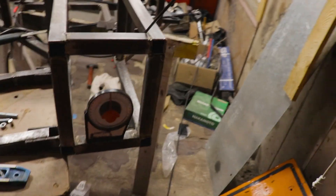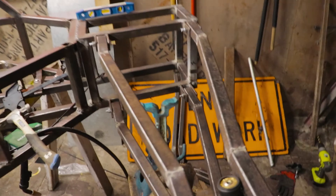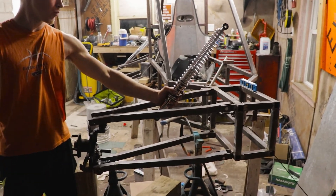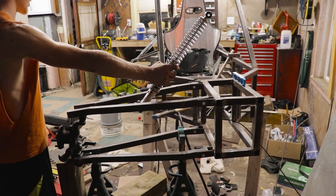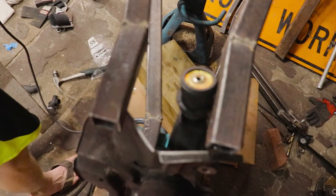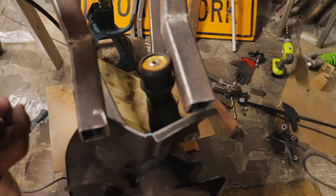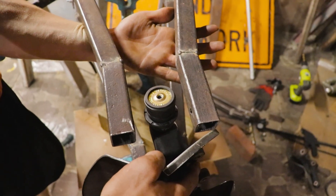As well as the other side, then we should be good to go. One side tacked up looks quite boxy, but once you get the shock in there, not too bad — something like that. Definitely beefy for sure. For the top here, it's a press-fit ball joint, so we're going to mill up a plate that'll be about 3 inches by 3 inches, and then that'll tap down into it to secure the top of the knuckle.